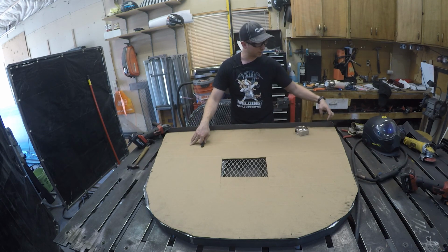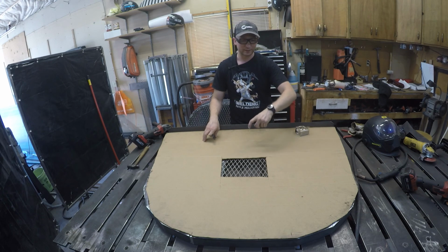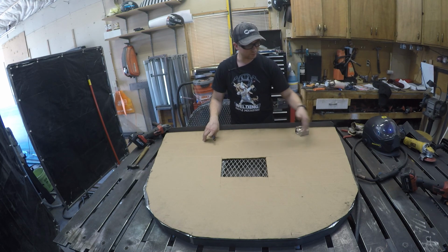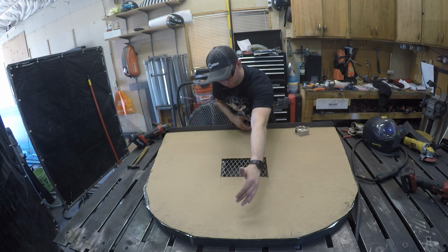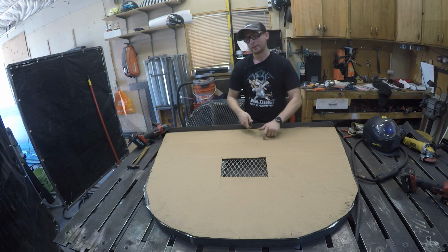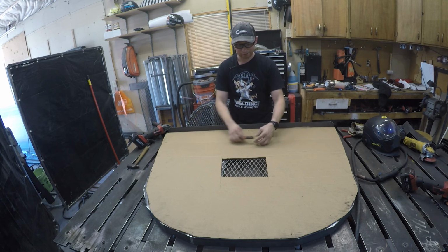That's why I like using the 2-inch angle iron that we used on this project, because it allows for some leeway. Most window wells are only about 1 inch wide, and so it gives you some movement. Once you figure out your overall width and depth, I add 1 inch both sides. So it's a 2-inch overall growth and a 1-inch growth that way. Each of those corner dimensions that I pulled, I would add 1 inch onto. And that would help me at least sketch it out on paper using a rule, a scale of some sort.